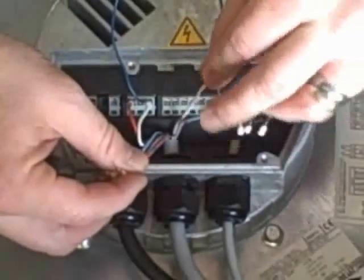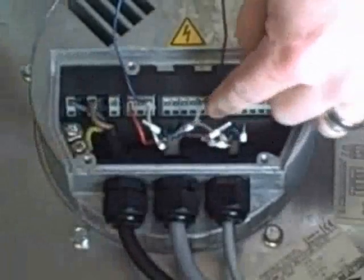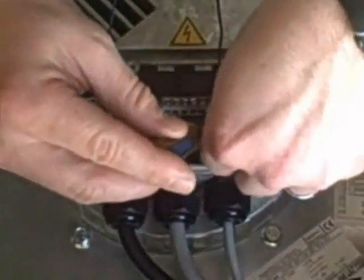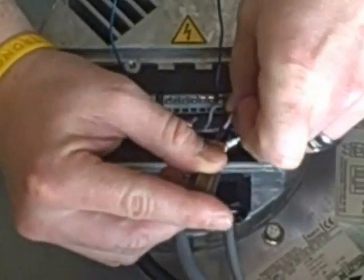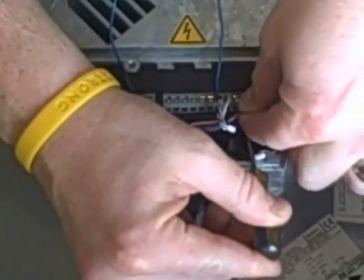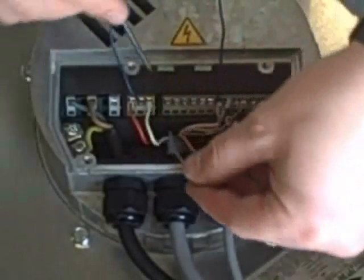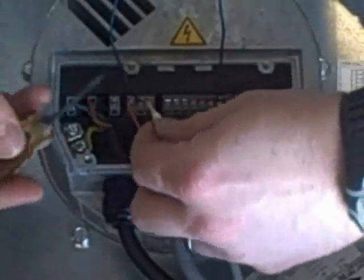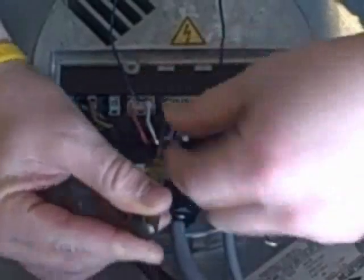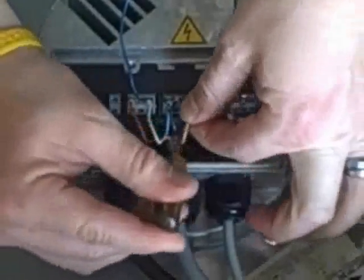Our gray and pink wires will be our enable switch for the potentiometer control. Gray goes to your 24-volt control, and pink goes to the enable section. You've got a red and blue wire — this is your ground wire, which goes to your output section. Then you're left with brown, blue, and black, which go to your actual potentiometer on analog one. Blue goes to ground, black is your zero to 10 input control, and brown is your control voltage of plus ten.